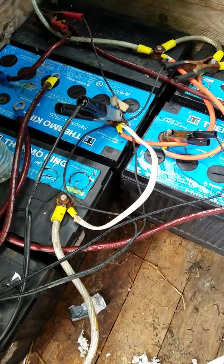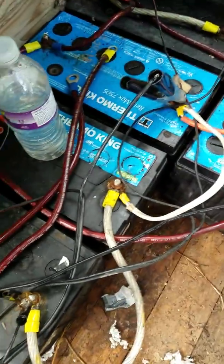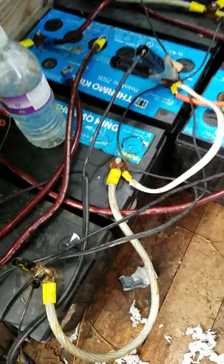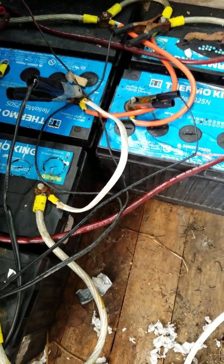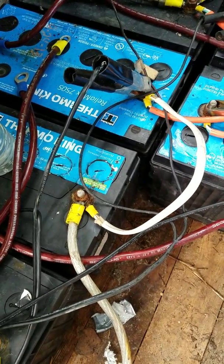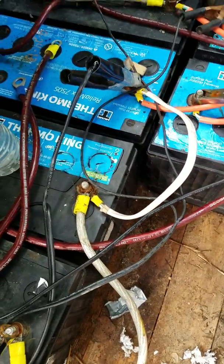I've got some small jumpers mixed with a bigger one, which doesn't help the balance. I don't need huge cable to run into the cabin — I'm not running a big load, just a few lights, a little TV, small fans to circulate air. As you can see there's some corrosion on them. It's moist out, and with batteries you get electrolysis — power flows through two different types of metal, electrons are swapped, and corrosion is the result.